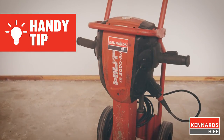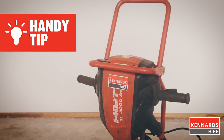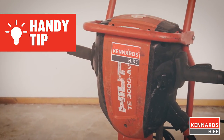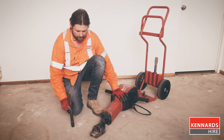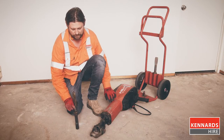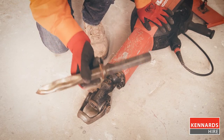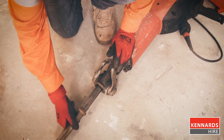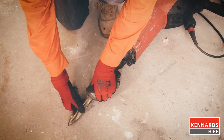Handy tip: if you need to break up concrete slabs, driveways or hard clay, then this heavy duty hammer is recommended. It still runs off the mains but it has more power. For breaking up slabs or brickwork you need a more pointed attachment like this one. To install the attachment, just open the lock chuck, slide the attachment in and close the lock chuck.